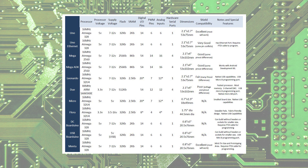Here's an overview of a lot of the Arduino boards available. They have a wide range of features, functionality, and power. Boards can range in RAM from two kilobytes to eight kilobytes. You can have anywhere between 14 and 54 digital I/O pins — digital, analog, and PWM pins. Most Arduino boards have Atmega microcontrollers integrated. They're also quite compact — on average about two inches or 50 millimeters.